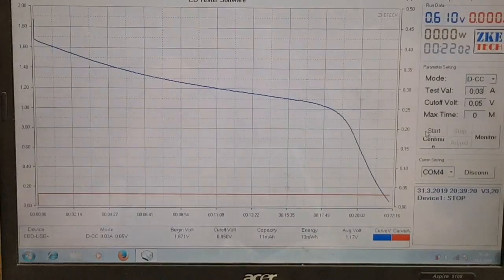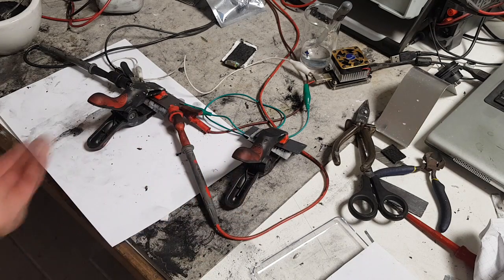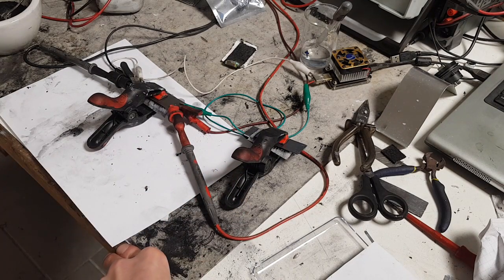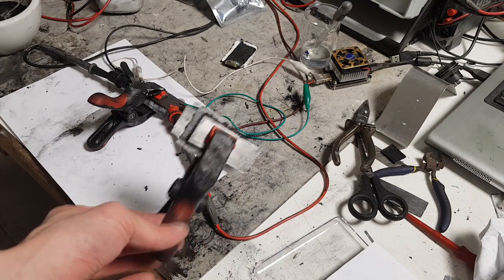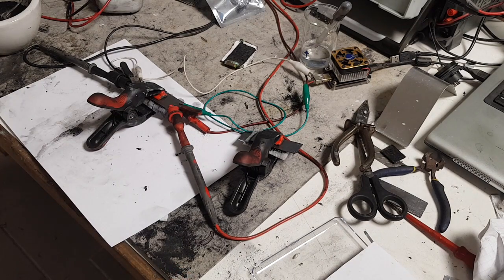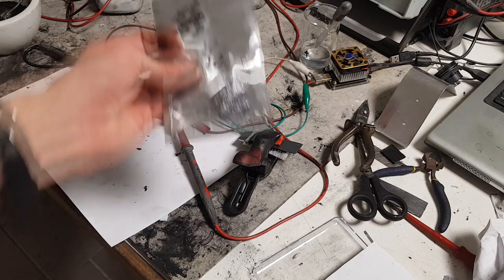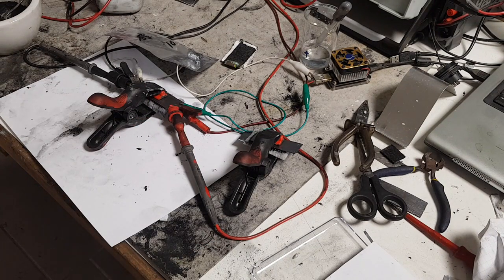I will try silicon in other setups. The standard carbon-carbon supercapacitor runs about 10 minutes with activated carbon on both positive and negative electrodes. Adding silicon gives two times improvement - I got 25 minutes. I will keep experimenting with silicon and we'll see each other in the next video. Bye!